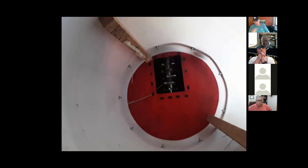At the bottom of that barrel are the knives, and those knives rotate from the gas motor that's attached. Depending upon where the barrel sits in relationship to those knives determines how slow or how fast the material is ground. One of the adjustments that we have to make is to lower the barrel about half an inch at the first attempt to see whether we can get those knives to feed the material a bit faster. When you see the video of the machine running, you'll see it's not feeding as fast as it could.